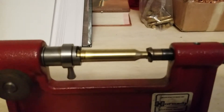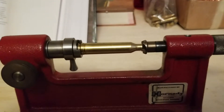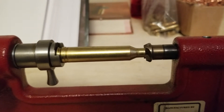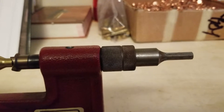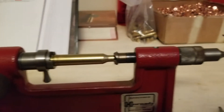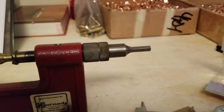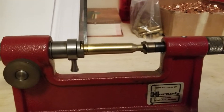I was having a few issues where this piece would not slide forward, so I had to pause to use two hands. Now you can see I've got the cutting head up tight against the shell casing, and I'm bottomed out on the total depth of cut — so this is set in place and I can just go ahead and start cutting. You'll also notice I've removed the crank handle that comes standard with the Camlock trimmer and bought the drill adapter piece, which makes trimming so much easier and less abuse on your arms and shoulders.